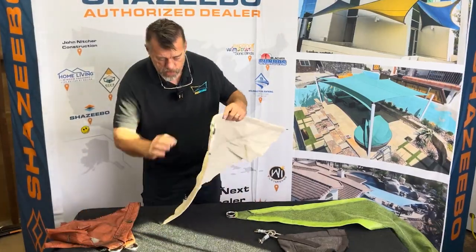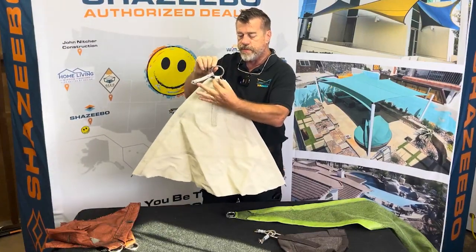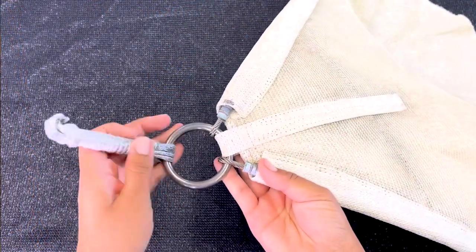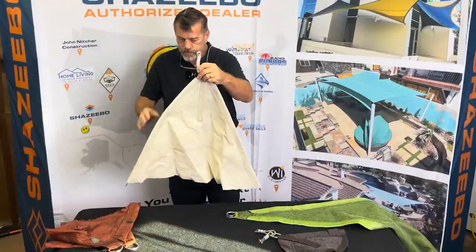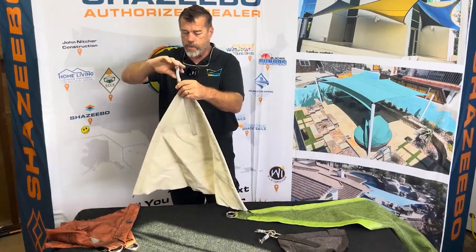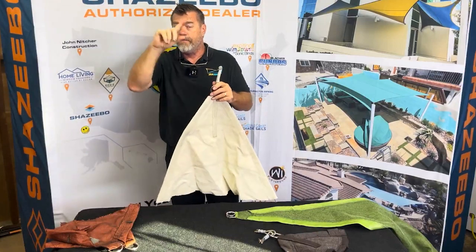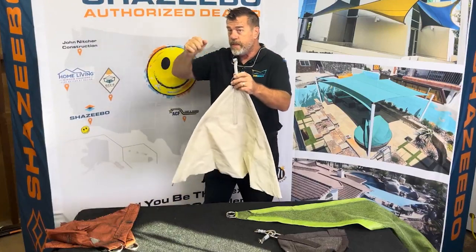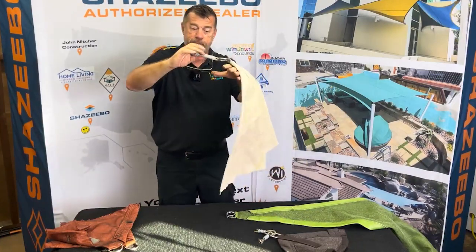This next one also uses a round ring, and they minimize it a little bit by putting thinner webbing on both sides. The cable attaches directly to the ring, so at some point they're going to have to tighten this, but at these corners they're locked off. This style with rope is very common in Australia — they'll go back and forth with a rope maybe four times and cinch it up. That's what provides the tension for the shade sail, then they wrap the rope around and tie it off as their attachment.